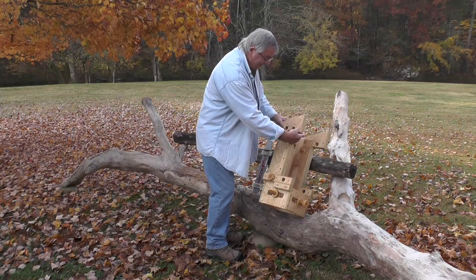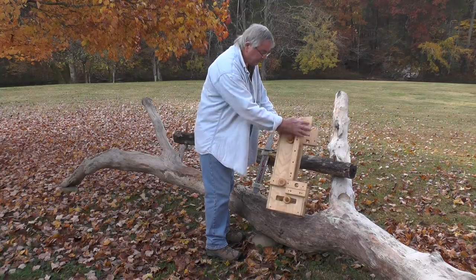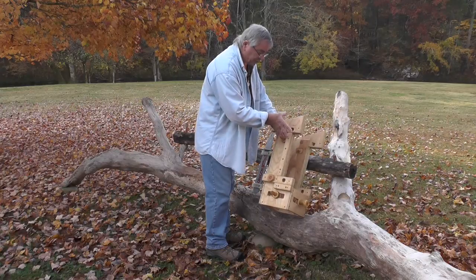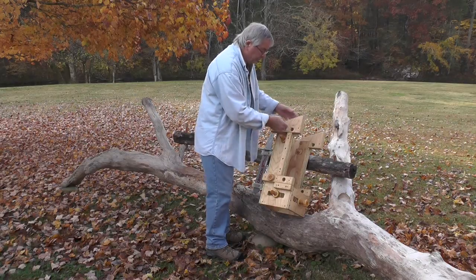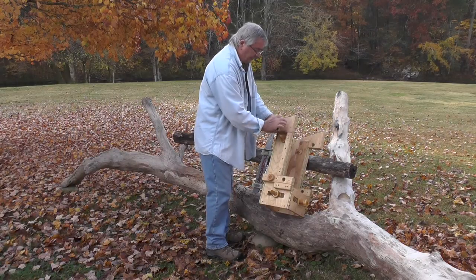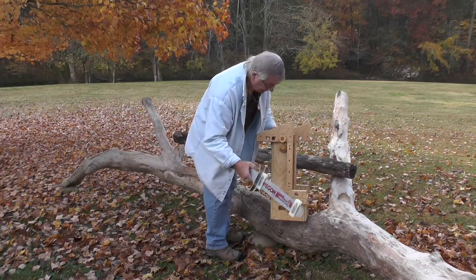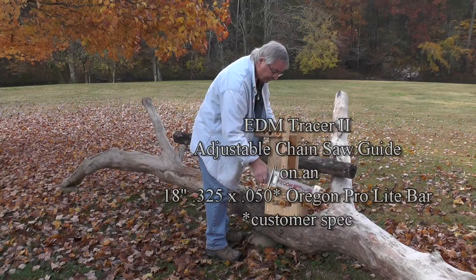There's the pin. Because it's moving laterally in this direction, it increases the height — moving it an inch and a half increases this height by half an inch. So now we're at six inches for this beam that's going to sit on top of the girder. And then the third position of these two templates up here would be in this position, which will give the customer a nice long ability to cut.